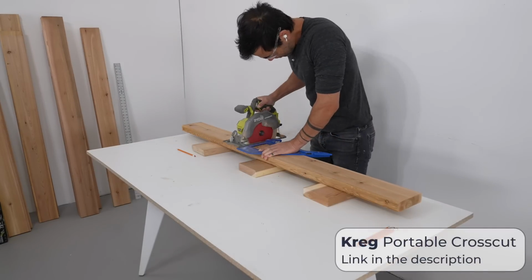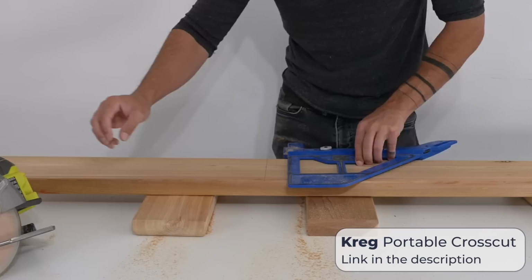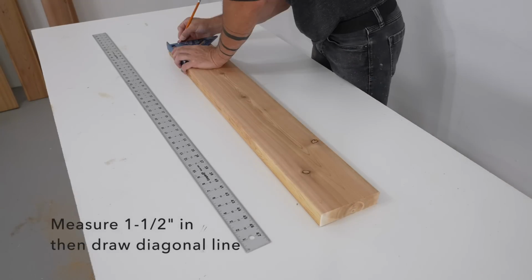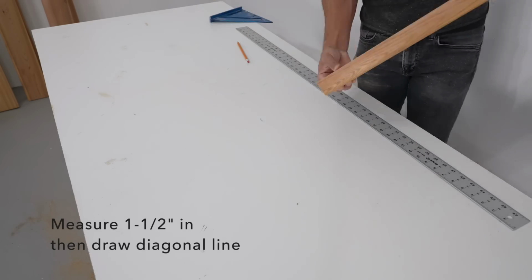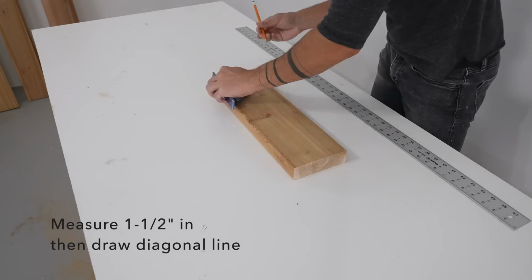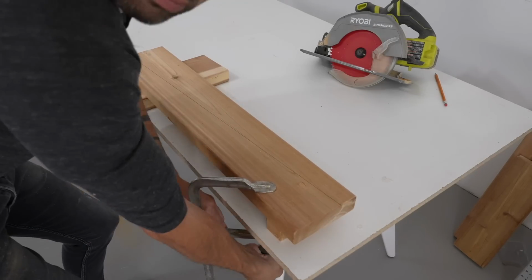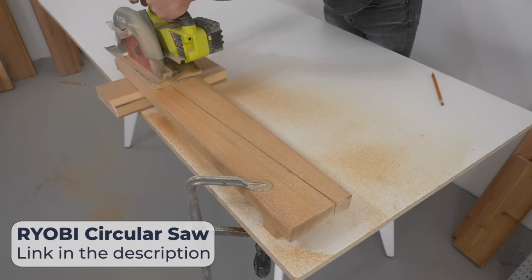So what I typically do in these situations is I just cut them into even lengths. In this case, 36 inches, 30 inches, and 18 inches. I'm using what I call the semi-triangle method, where I take rectangles, draw a diagonal line across them. In this case, I started 1.5 inches in from the edges, so that I can cut them into 2 triangular shaped pieces that are exactly the same. Or mostly exactly the same.